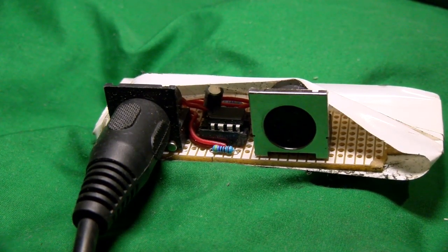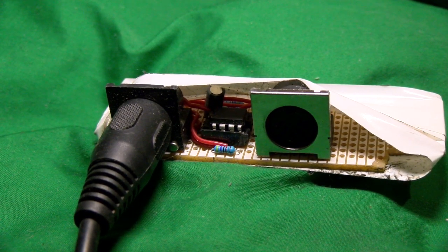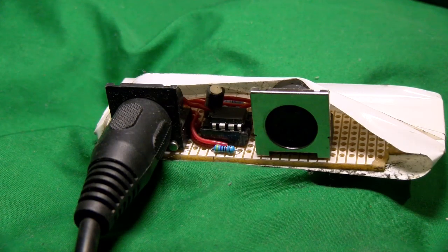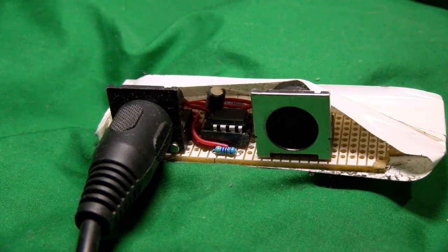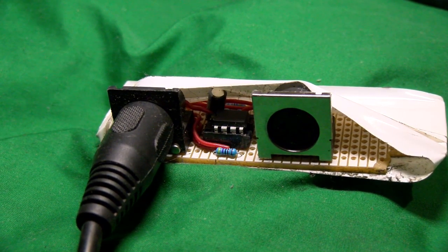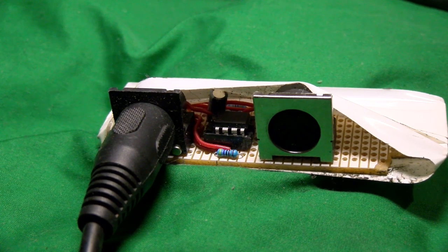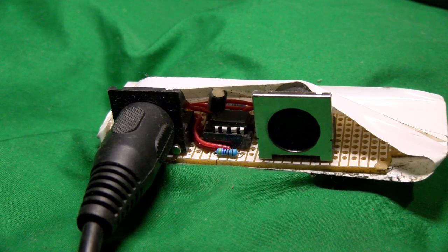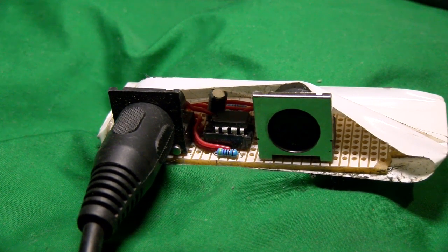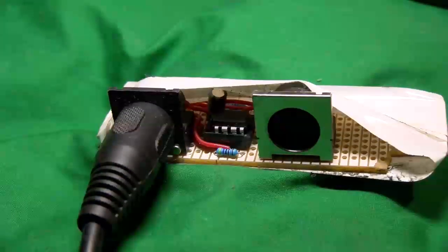And to be honest, I like this, because there's other solutions out there, a lot of which are overly complicated, inefficient with their own Unix-like OS running on ARM CPUs with HD video capability. That's not for me. I rather like the PIC solution and its ability to run right in line from the keyboard port. It draws only a couple of milliwatts of power, basically no latency, doesn't need any extra cables or anything other than the one that goes between it and the PC. This for me is the solution to use for this problem. No need to overcomplicate things. It does its job just fine. Had no problems with it yet.